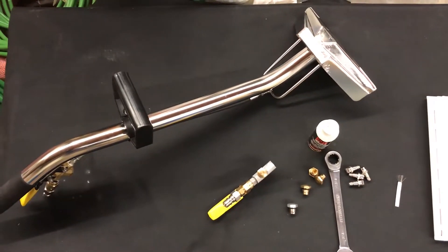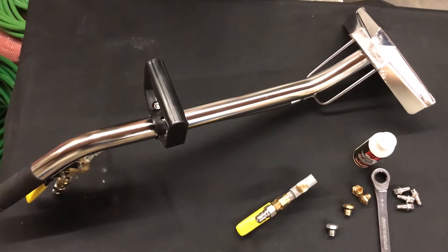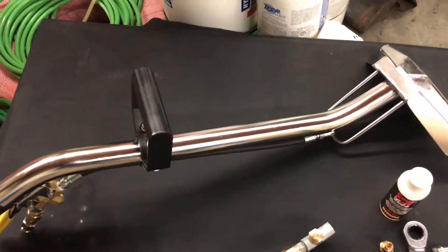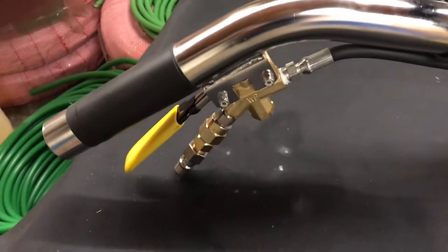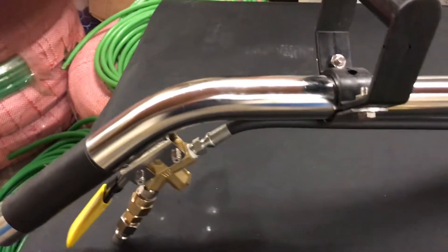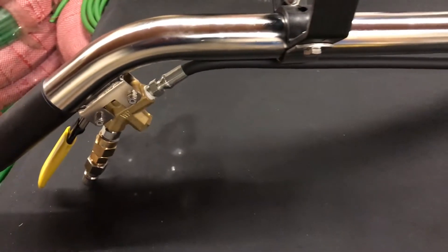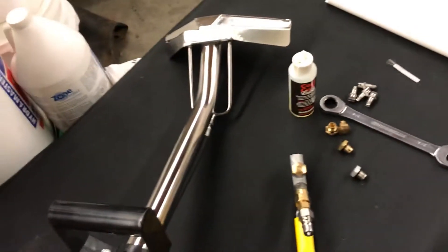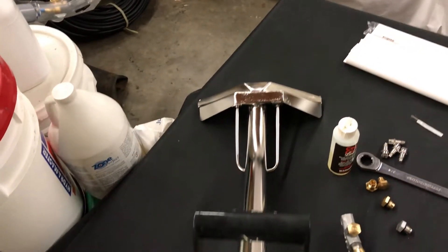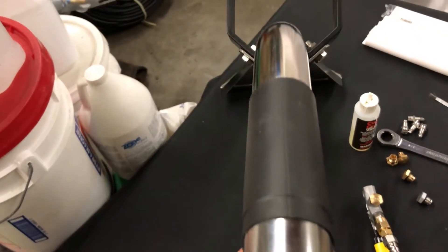I wanted to finish up the Grossman order from earlier today. Just built his stair tool — a nice little one-and-a-half inch tube S-bend, 10-inch head, 130 delivered tool. It's got the ultimate brass soft touch with stainless male, yellow jacket, nice little sleeve, good quality supply line that'll probably never fail — quarter-inch NPT threads on each end instead of compression fittings. 29502 jets down there, 10-inch head, nice S-bend, decent little handle — nice little tool for the price.